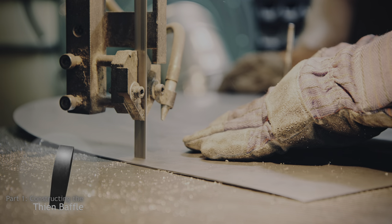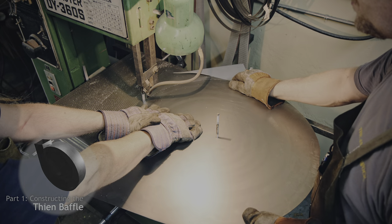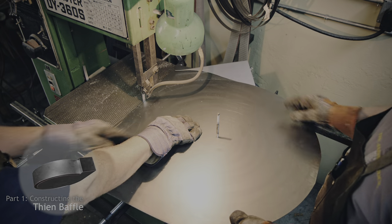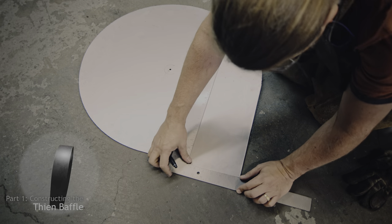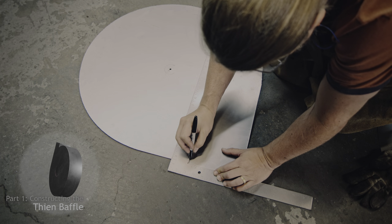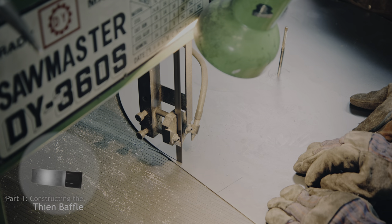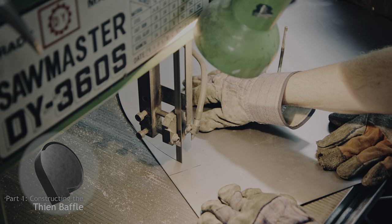While working on this project, I had looked into buying sheet metal tools but the smaller sheet metal brakes and rollers are not rated for 16 gauge sheet metal. The tools that are rated for it are much larger, heavier and more expensive. One circle is cut out and where we stopped cutting is where the air inlet to the dust collector will be located. The size of the inlet will be 6 inch square, which is the same dimension as the height of the baffle and big enough to not significantly reduce airflow.